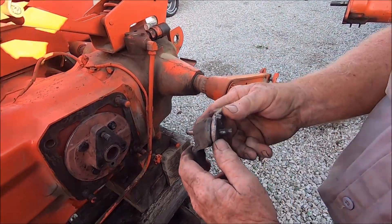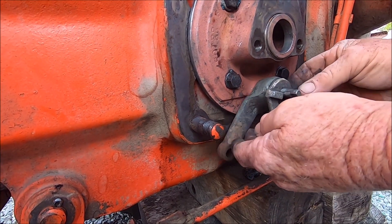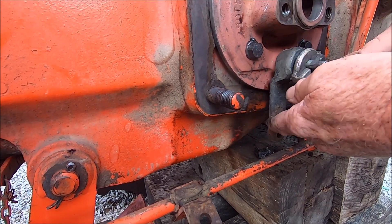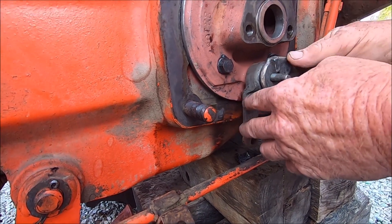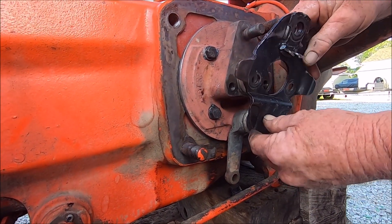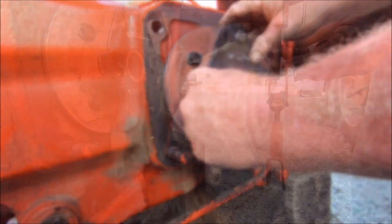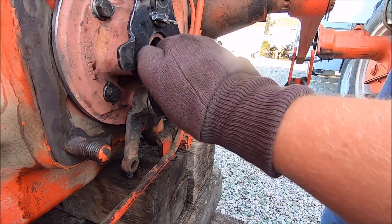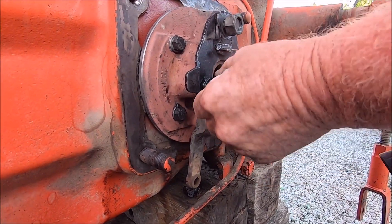Now we've got to put these bolts back in - I'm gonna help dad because this looks like it might be kind of a mess for just one person. With the silicone on there, the white lithium grease on the new seal, and blue Loctite on the bolts, dad's gonna run those in a little bit at a time - not to stress anything - in a crisscross pattern, just like you do on your wheels. We'll put that funky little deal on the right way first time. The brake goes in like that - that's the way it's supposed to be. That's the one that came with the extra greasy side.